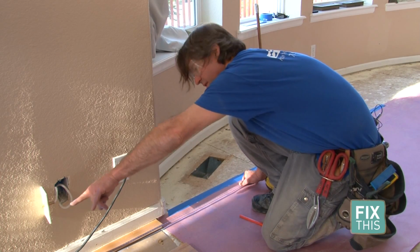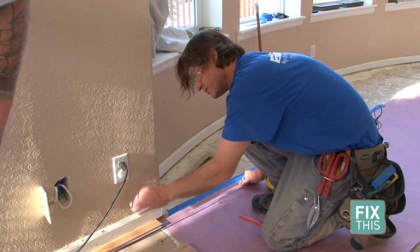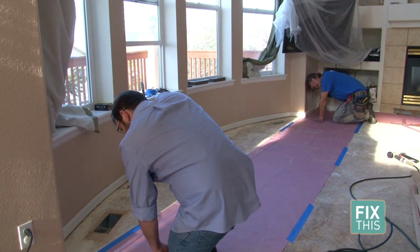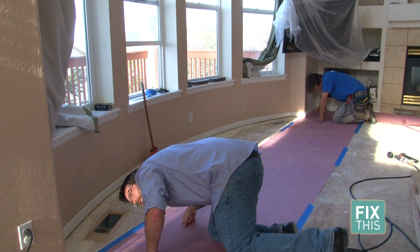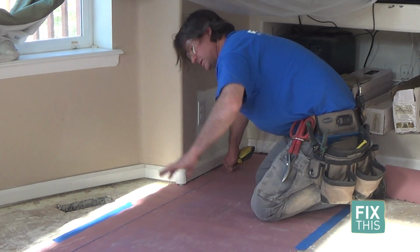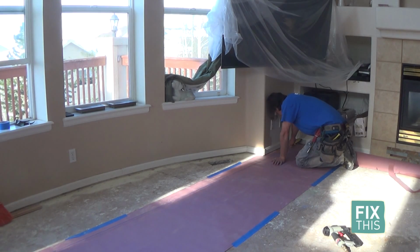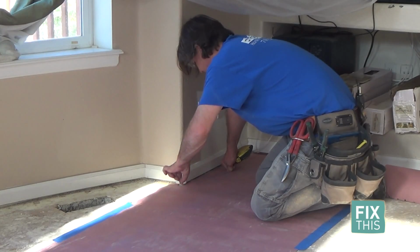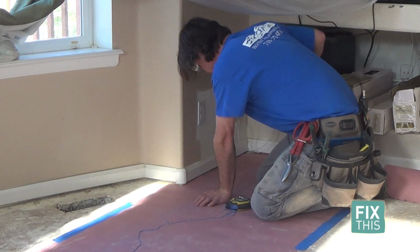Now you need to lay out a straight line across the room. You can't use a wall because walls just aren't straight. This is where you will lay a chalk line. This helps make a straight line that you can set your wood on so you have even flooring. Have someone hold the end of the chalk line. Stretch the line across the room. Measure so you have your chalk line running parallel to your starting wall. Snap the chalk line so it leaves a straight chalk mark on the subfloor.